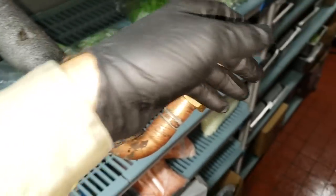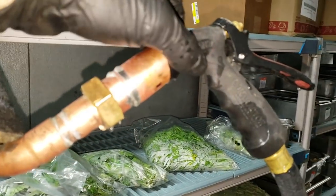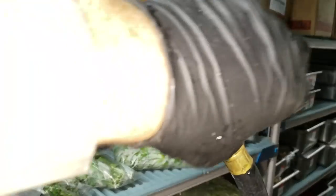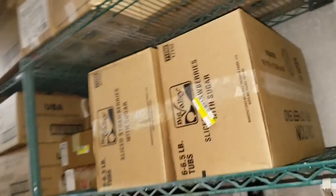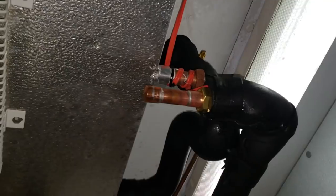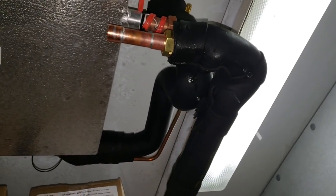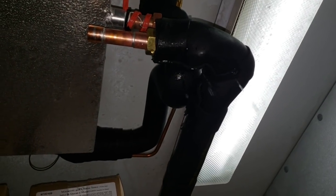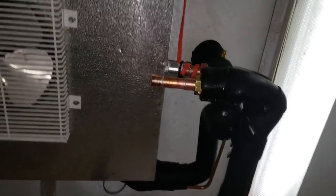I made up this rig so I can put it on here — it's not perfect, but it lets you apply pressure, and you can even tape your handle shut and let it go. What I also did was go into the walk-in freezer and put it into a defrost mode. I used the other end of that union and welded a cap on it so I don't have water pouring out when I'm blowing from that side. Then I can reverse it and do the same thing on the other side — blow the other direction, vice versa.